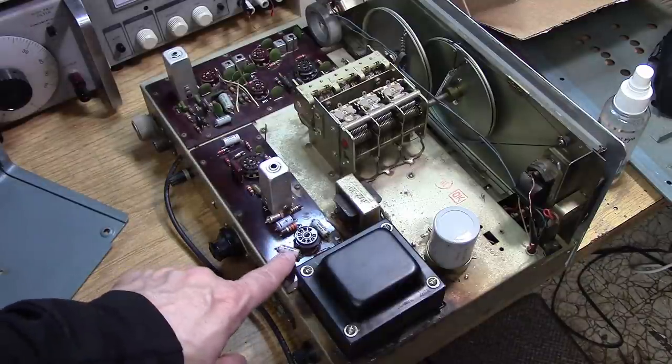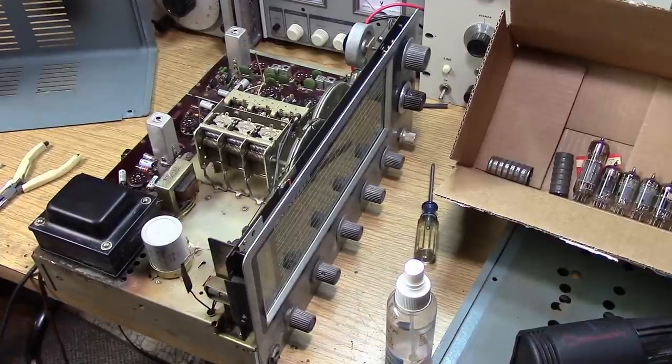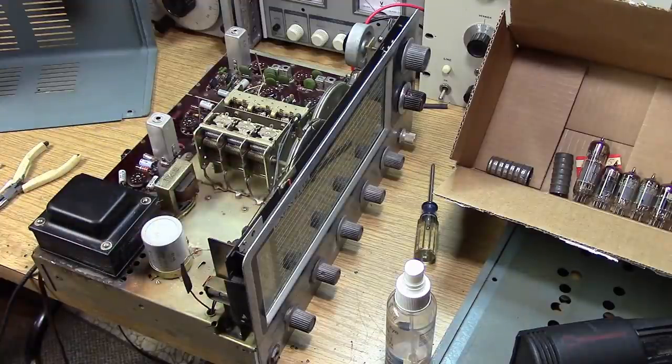The paper caps, like this 0.005, you can probably keep those. But if you want to change those out, put some yellow Mylar caps in — plastic film or metal film is fine. The resistors you should check each one to see what value they've increased to; generally they will increase in value, and if they've gone up significantly you can replace some of those as well. After some basic cleanup, the dial string and the pulleys look quite good — they're nice and tight, and there's no need to restring either the band-spread or the main tuning dial strings. Just make sure everything's lubricated and don't get any grease on the spindles. The knobs are going to need a soak, so removal of the knobs is next.